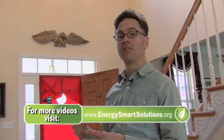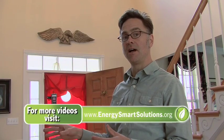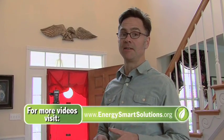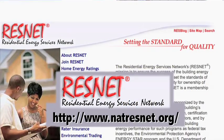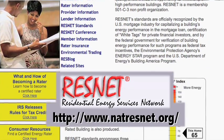What I'm going to recommend to this homeowner is that they hire a professional company to come in. They can use what's called a flow hood and test the output at each duct at each register. That tells you which ones are getting less air than they ought to, and then maybe there's a leak along that line — that will help identify the problem. They'll seal all the boots to the finished surface and do some work on the air handler to really knock down some of this leakage. Again, my name is Andrew Grigsby. I'm a certified home energy rater — there's probably one in your neighborhood. Go to the website of ResNet, which is a national association related to certified home energy raters. Get an energy audit, learn something about building science, and learn about the opportunities in your house to save money and save some energy. Thanks.